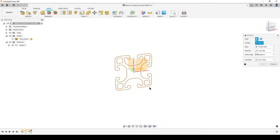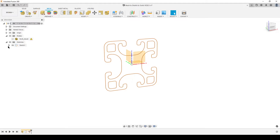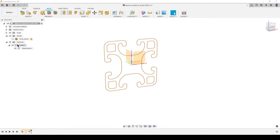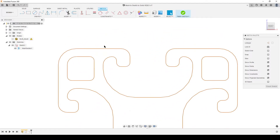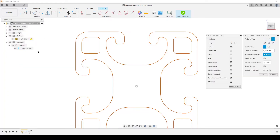The mesh section sketch shows in an orange-brown color to indicate it's not a usable profile. What we do instead: open the sketch folder, right-click the mesh sketch, and choose Edit Sketch. We can turn off the origin point to see more clearly. We'll do some tracing. Under Create, there's a special tool called 'Fit Curves to Mesh Section.' This pops out a dialog with options: lines, arcs, splines, closed splines, circles, and so forth. We'll start with lines.